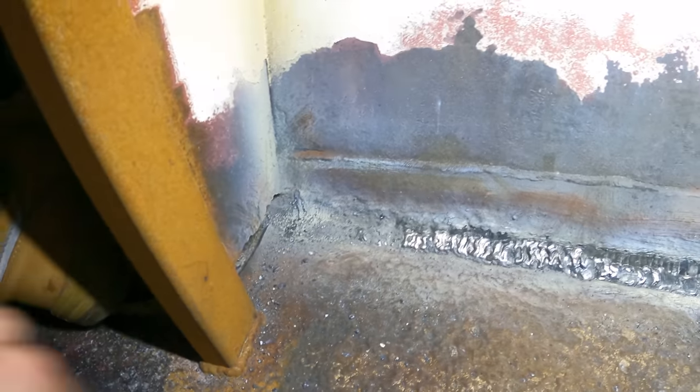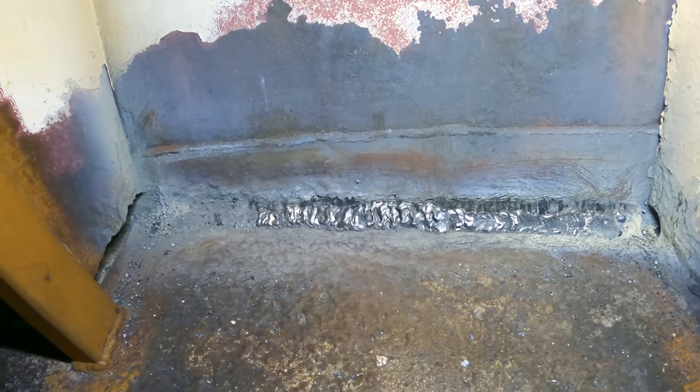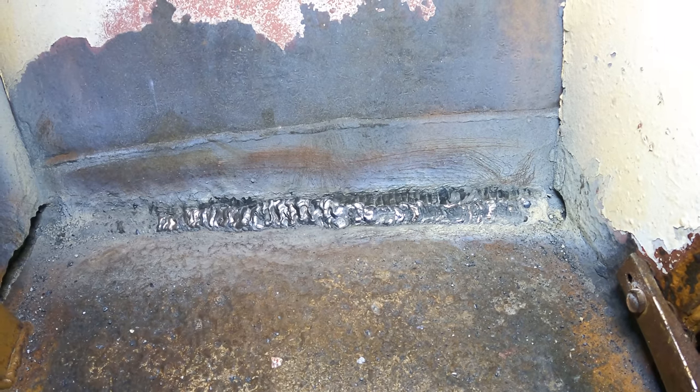Just keep adding steel. You can sort of see down the back there, there's bucket loads where the corrosion was and that's probably going to be close to 10 mil thick now. That'll be pretty chunky, especially down in here. That's all solid steel. That'll be probably at least half an inch thick. So yeah, simple fast way of fixing localized corrosion.